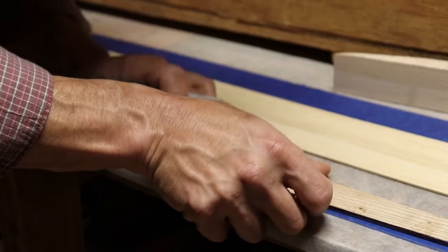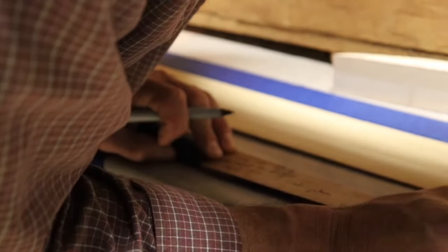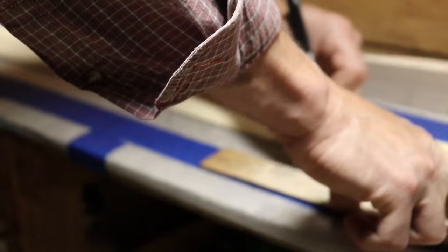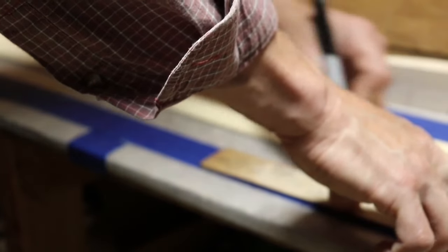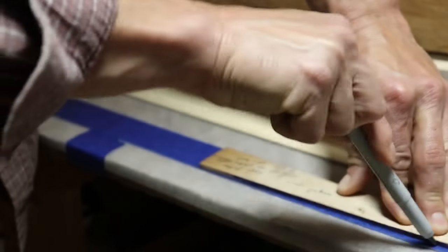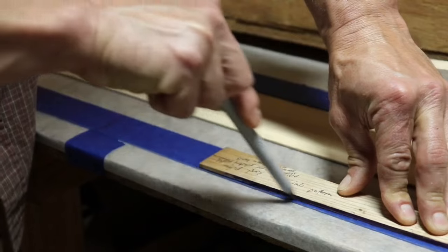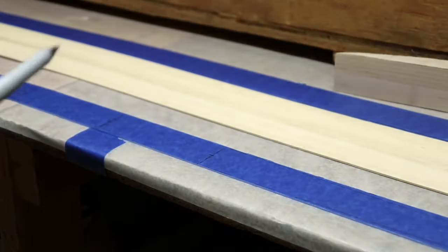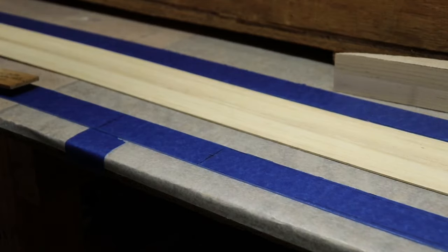Here I'm showing a template that I use — because once you make a lot of bows, you find you don't want to measure too much anymore. So you make a template and just lay it out and trace it. In the book I give you increments every two inches of exactly what the width is, so you have the profile pyramid lines exactly where you need them.